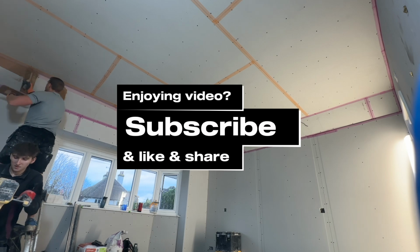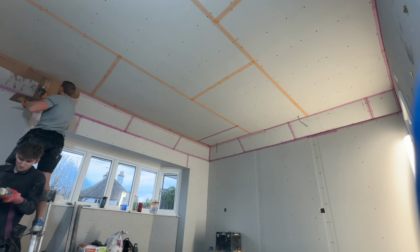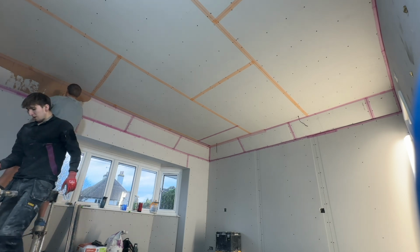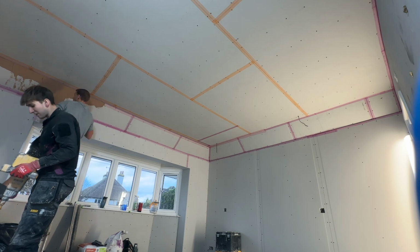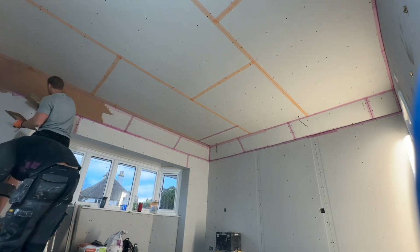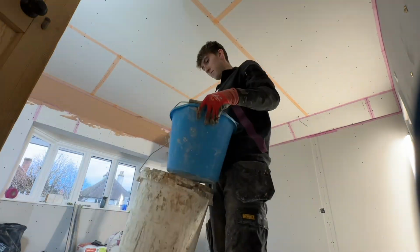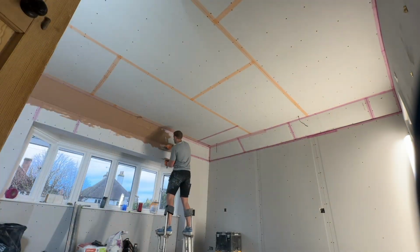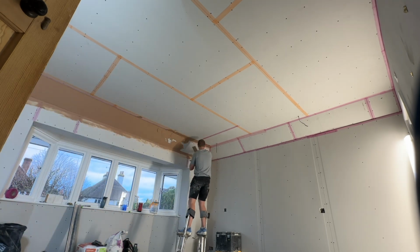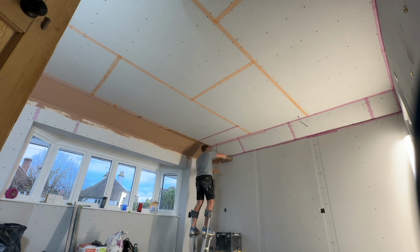You can see on this one, it's got two very small sections of ceiling at a slight angle. We call them skeelings in the industry. Whether or not that's their technical name, certainly what we call them. I'm getting them done first because they are going to be connected with a little curve to the main ceiling. Some people have even connected them to the walls as well, but most people like a straight line, so there's a clear separation between the ceiling and the walls, a nice sharp edge for painting.